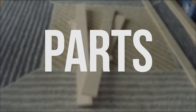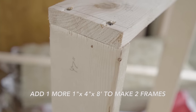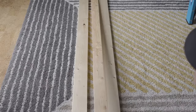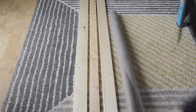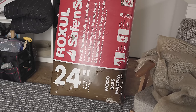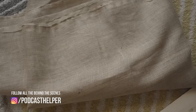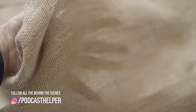Next, the actual materials for the panels themselves. To make one panel, I bought two eight-foot pieces of one-by-four common board — just cheap, lightweight wood — which I'll cut into the frame pieces: two 47-inch pieces for the sides and two 24-and-a-half-inch pieces for the top and bottom. I also bought a 10-foot one-by-three board for the back brace and corner pieces. For the backing I used breathable weed barrier fabric, a box of number six deck and fence screws at one-and-five-eighths inches long, rock wool safe and sound insulation in two-by-four-foot batts (eight per pack), and burlap from a local fabric shop — very breathable, allowing sound to travel right through into the insulation.